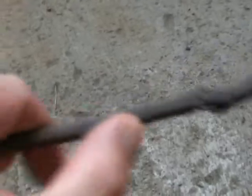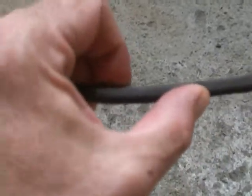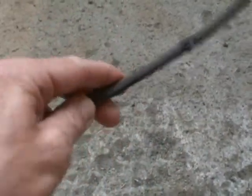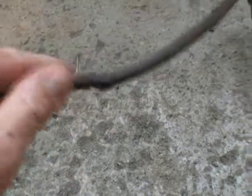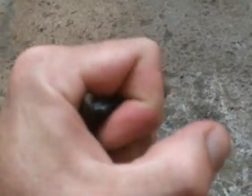As you can see, they're very dangerous. They've got exposed wires, and they're just brittle. That's just the nature of the game with the old Hammond organs. So if you buy one of these that has the cord already attached, and it's the brown cable, be prepared to just replace it, because look at that, it just cracks right apart. It's so brittle. Look at that, cracking the Hammond organ cable.